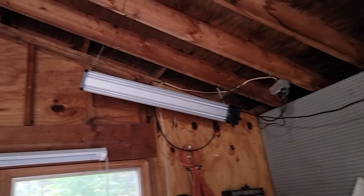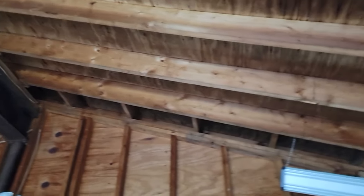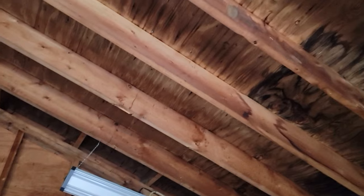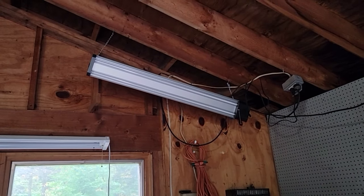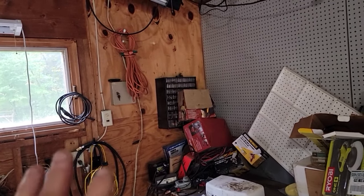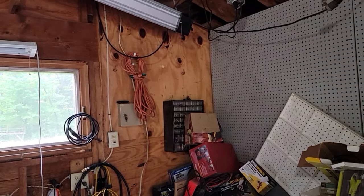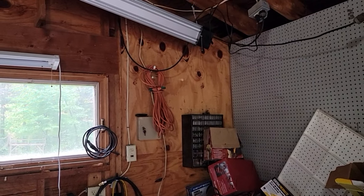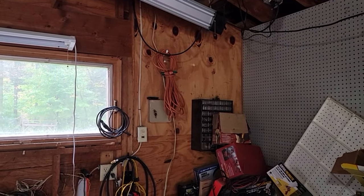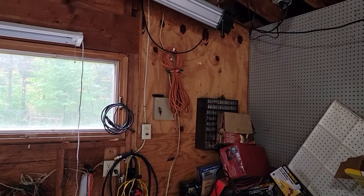This is a great time to insulate this garage. We've got a heavy 12-inch by 6-inch steel I-beam in the ceiling, two-by-eight ceiling joists, everything 16 on center, two-by-four walls, plywood on the roof and side walls, cedar on the outside. Good quality construction, sitting on a concrete block on the sill. I want to put insulation in if there isn't any, and put drywall on there — though plywood is good in a garage because you can put a nail anywhere. I don't want plywood directly behind the wood stove; I need a fireproofing wall, so I may use roofing steel or fireproof cement board.